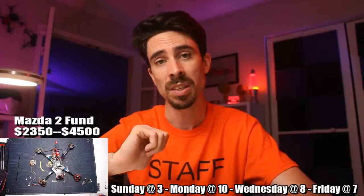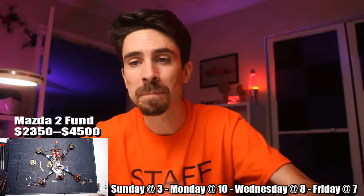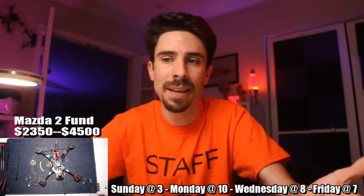The 800 degrees is just, for whatever reason, in my brain, when I blip the stick to the plastic and back to center, 800 degrees lands me perfectly inverted. I don't really ever do a full roll, but when I want to do a full roll, 800 degrees lands me completely flat. I tried for a long time to run the max rotation rate at like 600 and 700, but I would always under rotate and I would have to add a little bit more, and that's just silly. Like I said, I just don't use the stick ends much, so having such a violent knee on the rate graph doesn't really matter, because I'm just never putting the stick out that far.